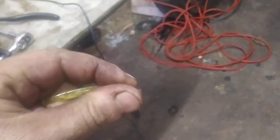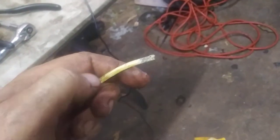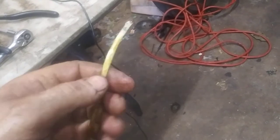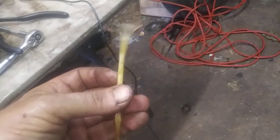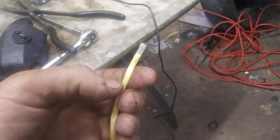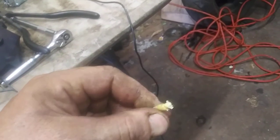Now that's what the fuel lines will usually look like — they just crumble. It's from the ethanol in the gas. You want to use non-ethanol gas in your two-stroke equipment, because the ethanol just destroys it. It's just crumbling inside there, and all those little particles go inside your carburetor. It's just horrible stuff. So non-ethanol gas is highly recommended.